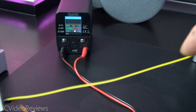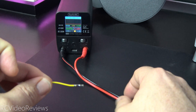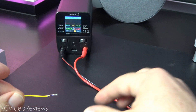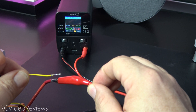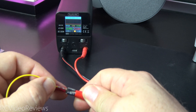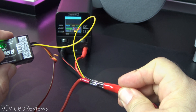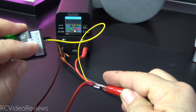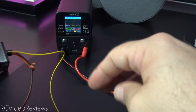Then the last thing you need to do is connect the other end of your VBAT line to your main battery. So imagine that this is my battery — the power supply is doubling up as my battery. I would connect this to an XT60, just solder it onto the XT60 lead coming off the battery connection on the ESC. But to simulate that connection, I'm just going to connect it to the positive lead of my power supply — a single lead coming off the flight battery positive going into the VBAT connector on the R168.